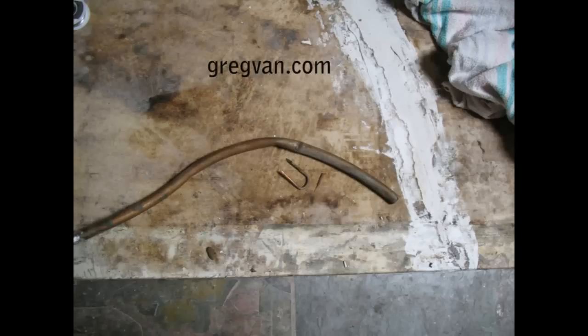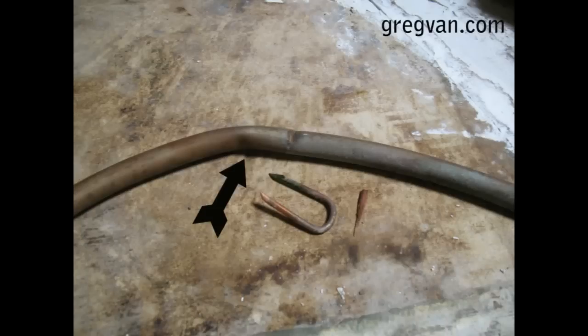Here's a soft copper water supply pipe that was removed from a home that was built in the late 1950s. And if you can see, we're going to pull up a little close up here. It's got a dent on the one side here, and it looks like this dent was caused while the plumber was trying to make the bend and ended up denting or crimping the pipe.